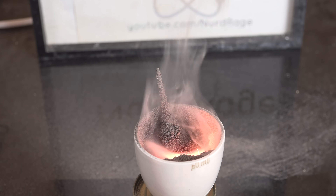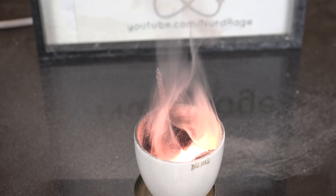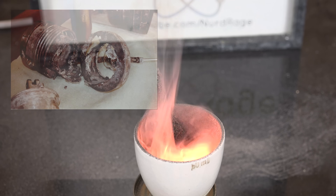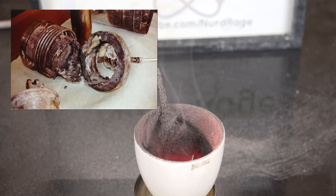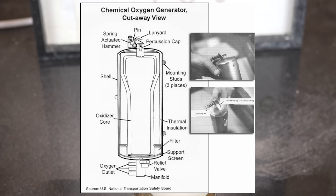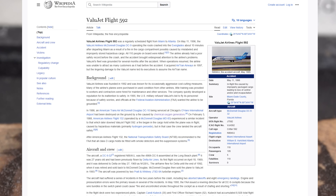Commercial systems are quite safe, but there have been some notable accidents. One was responsible for a fire on board the old space station Mir — although the reaction is reasonably well-behaved, it is smoldering and generating a lot of heat. Normally these chemicals are confined to special canisters and gases pass through heat sinks and smoke filters to make the oxygen usable. Something went wrong on Mir and the chemical oxygen generator began shooting out fire, likely due to contamination during manufacture. A more tragic catastrophe was the ValuJet 592 disaster, where these generators were improperly transported in the cargo hold. A canister initiated and, because it wasn't properly installed into a heat sink and gas handling system, the heat spread and initiated other canisters. The whole cargo hold became an oxygen-fueled inferno, and tragically all 110 lives aboard were lost.